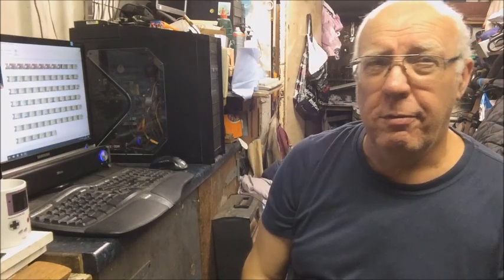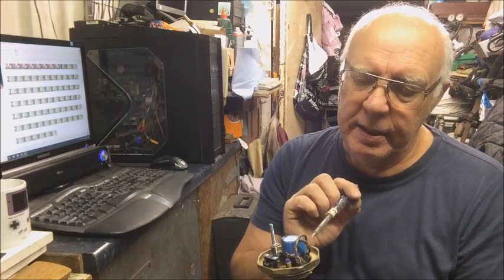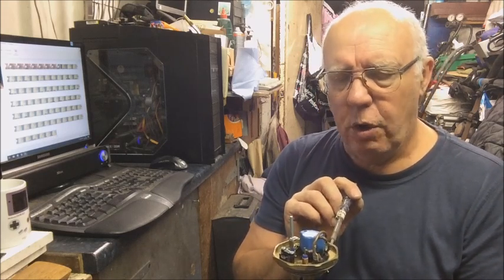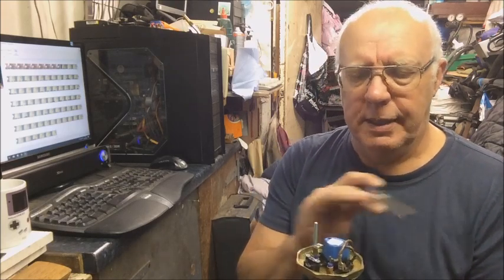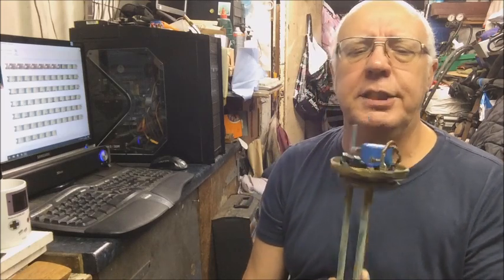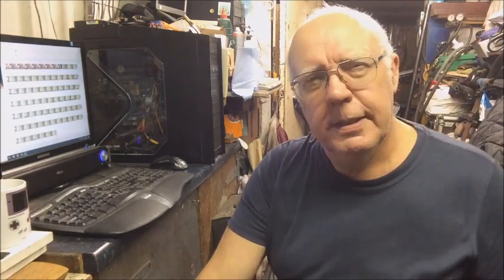I went over — you've got the heating element, you've got a thermostat, preset I hope at 65-70 degrees. This particular model also has a little reset switch with a red end — if it gets too hot it'll pop up and cut the power off. I pressed the reset button and touched the other side, and I had power on both sides. But as I was watching, at the base of this reset switch it started to glow red — a tiny little red dot grew brighter over time — and the cable started to melt, all the brown insulation melted off. I was fortunate that the overflow leak happened, because otherwise this could quite easily have started a fire. It ought to have blown the fuse and cut the power off, but I didn't let it go that far. So that's why I've had to change this. There we go folks — a little bit of home maintenance done. Never knows, could have been worse, could have been a lot worse. See you soon.